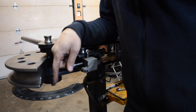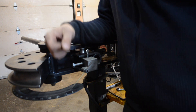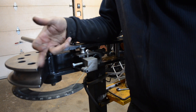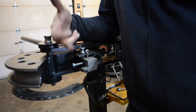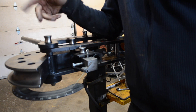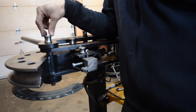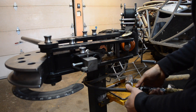I don't know exactly which angle I need to go to yet. Remember the angle we saw before was 135 degrees, but I only need the complement angle of 135 degrees, which is 45 degrees. I always add approximately 2 degrees for spring back, so the number I'm going to be looking at is 47 degrees. Now I'm ready to start the bender and actuate the lever.